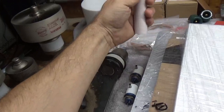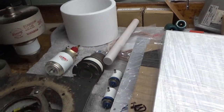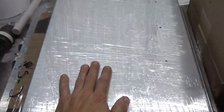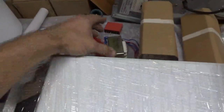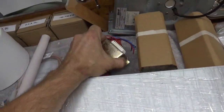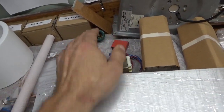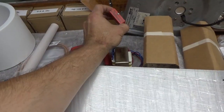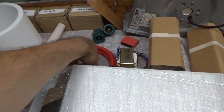The Teflon rod for the plate choke — I'm going to cut that down, obviously. I'll use Teflon wire wound properly. Here's the prefab cabinet. Here's the transformer for the relays. The relays will be switched by this right here, so the radio will have total isolation from those relays.